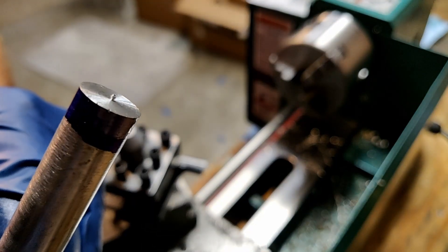Now I'll set up the tool to properly take some turning passes. I'm squaring up the tool post to the lathe chuck so that the tip of the tool interacts properly with the work. As the marking fluid dries again I'll wipe off any chips that I've made. Here you can see me setting up my witness mark — just a light touching of the tool to the work so that I can properly measure how deep each of my cuts is going. At this point I am using the power feed feature, which turns the lead screw at a certain proportion to the rate of the chuck, and that really helps with automating the turning process and improving surface finish.